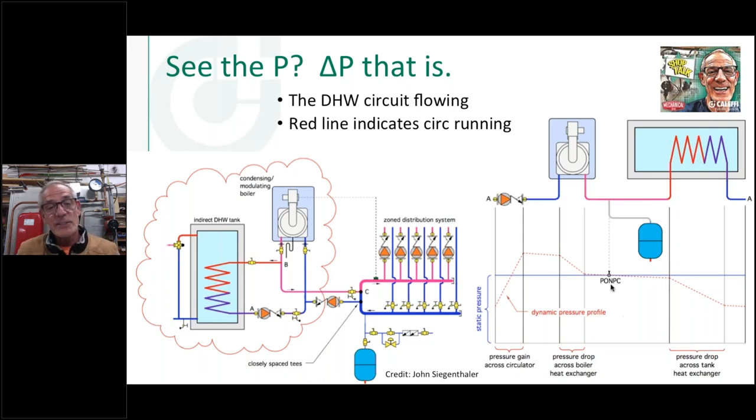So if you look at this, you say, well, that looks like a great place for an expansion tank. This pump that's pumping into the boiler is pumping away from it. Now, in this example, one or the other is going to run here. They don't both run simultaneously. So on a call for domestic hot water, the main circulator shuts off here that's going into the loop over here. This we'll call the primary loop, because the loop that has the expansion tank connected to it, I learned this recently, is the primary loop. So if I were to connect this tank in over here, this would be the primary loop, the boiler loop. If it was over here, that would be the primary loop. That's what I've been told.